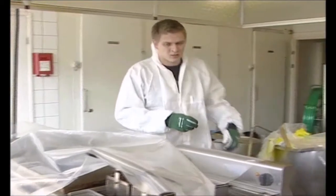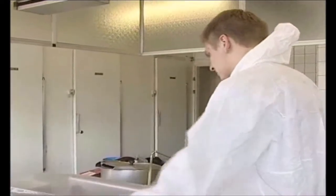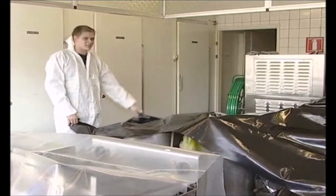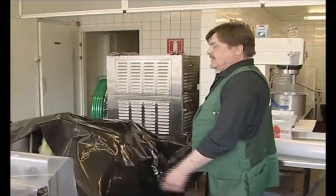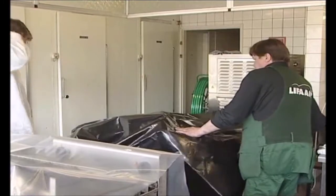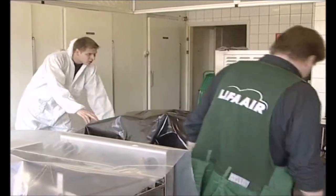Always remember to cover the surfaces, i.e. grills, ovens, etc., preferably the floor also, below the canopy, with plastic and/or cardboard. When finished, you can roll the plastic off with the grease on it in a clean manner. Remember to have extra rags to wipe your feet before moving around. A rule of thumb: you can never have too many different types of hand tools and/or rags and other consumables.